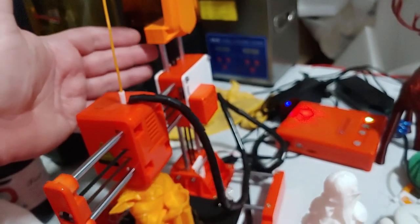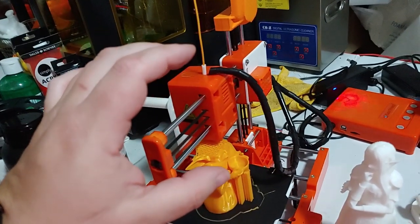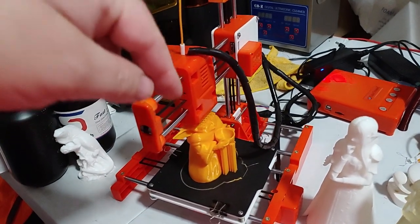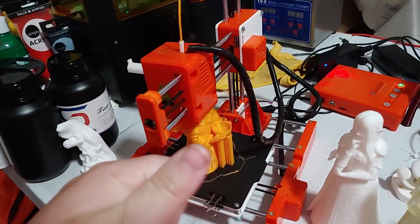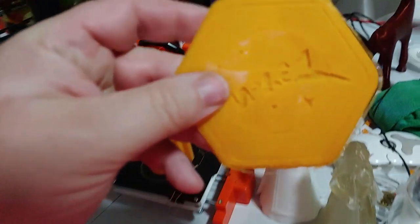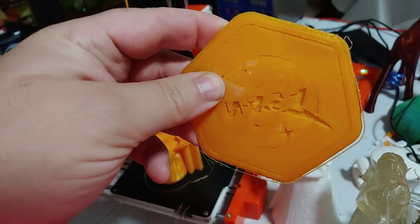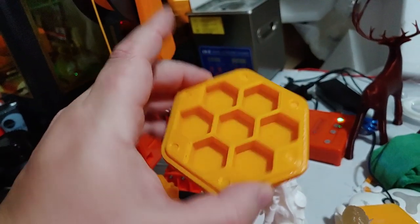The problem is you're using a belt for your Z-axis, which means there's slack in that belt. So when you home the printer, the tension is applied going down instead of up. As the printer moves up layer by layer, it's not actually moving. So those first two or three layers are just being rammed into each other. You can see that pretty effectively on this — how those first couple layers get smashed together. And you can see how the NASA logo is reversed and the first few layers are just smashed together, that's why you can see right through to the infill.